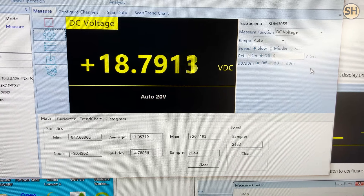I'm going to leave this just a little bit higher — arguably just a bit more voltage, plus or minus a volt. This one is reading 12.17 volts, so that buck converter, or DC to DC converter, is now set.